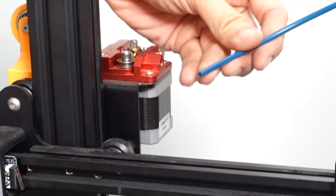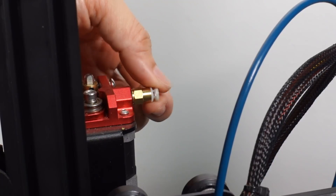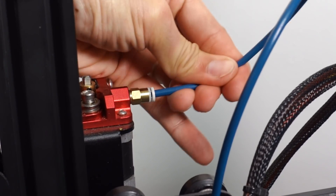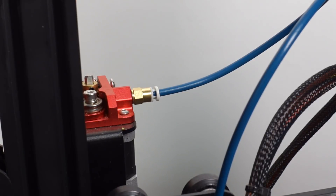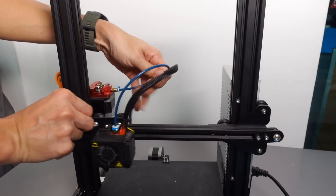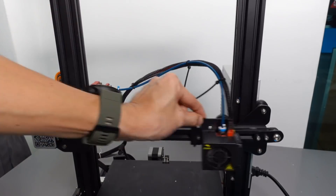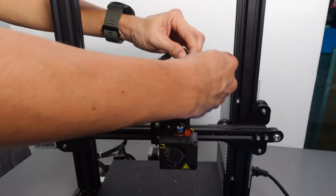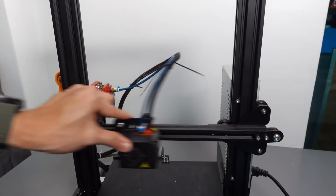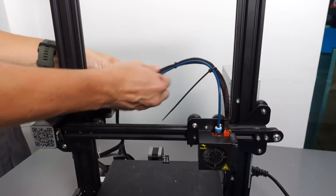The extruder end is fairly easy. We just insert the smaller pneumatic coupler and fasten it by hand. After you're done, just push the PTFE tube all the way in, and then clip it tight using the blue clip. Remember to lift up the pneumatic coupling holder before inserting the blue clip. To tidy up the Bowden tube and the cables, we are going to put cable ties. At this point, I make sure that I lightly tie up the cable tie first, and make sure that the Bowden tube can move freely together with the print head. I'll make final adjustments to it. Once I make sure that the PTFE tube is not bent or snagged, I will then tighten the cable ties and cut the ends away.